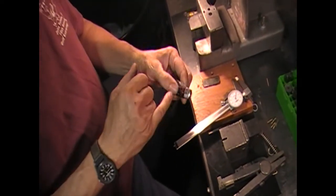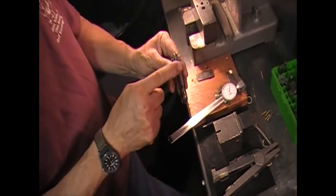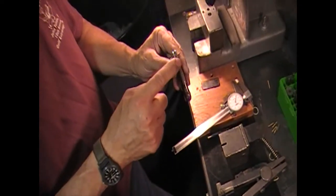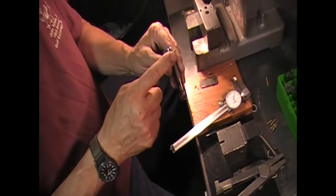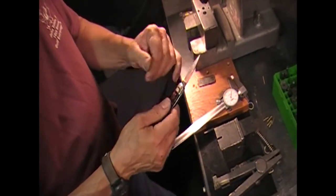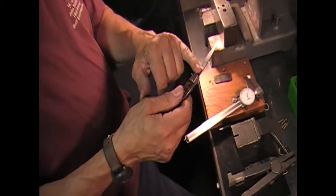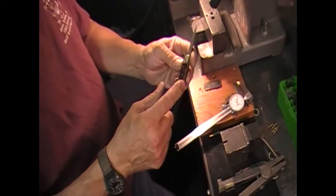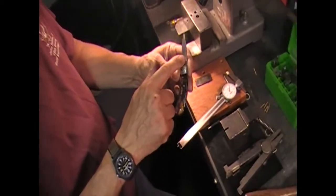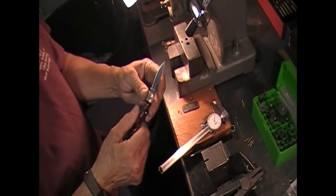The lock lever is not made out of the same steel as the blade. This would be a lower grade stainless — still hardenable, like 410 or low carbon 420. But your blades would be made out of 420 high carbon or 440A stainless. So the lock lever was cheaper, didn't need to be as good a cutlery steel, so you didn't always get the same thicknesses that you wanted.